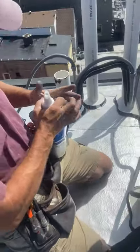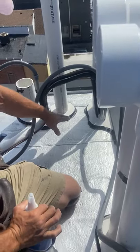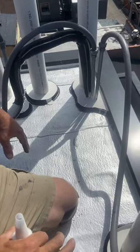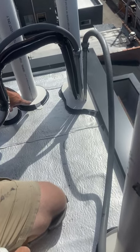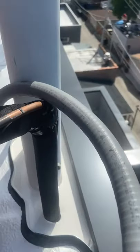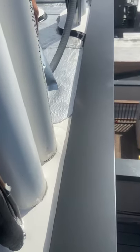Those three are done. You can see overflow is fine because the roof is sloped. You have to make sure one side is completely filled so the water can run out of the form. The top of the form is a little low on one edge, but on the bottom it's totally full — that's fine. A little bit of overflow is okay, it's not a problem. I usually start from the top and I have to be really careful not to overflow it because this sealant is really expensive.